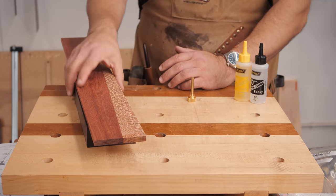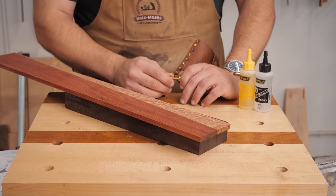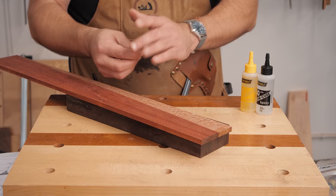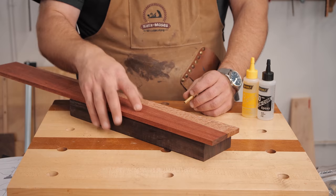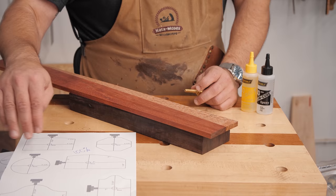When you think about thickness, these knurled knobs that come with the kit are three-quarters of an inch wide, so you want to definitely be more than that. I'd recommend going an inch and a quarter for your final thickness — but as long as it's more than three-quarters, you're going to be fine. After you glue up, you're going to want to square and mill your stock. When you drill for the inserts, you want to make sure that you're drilling on a flat reference area because that's going to set you up for success.